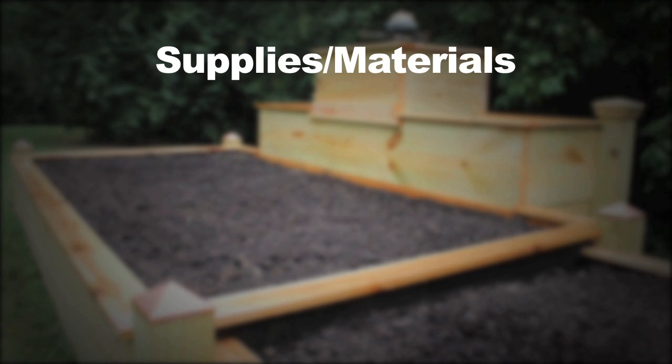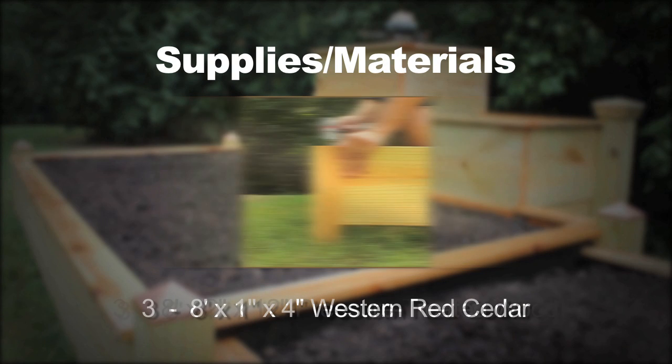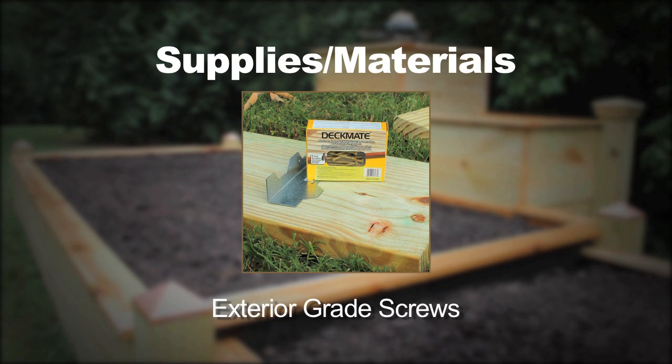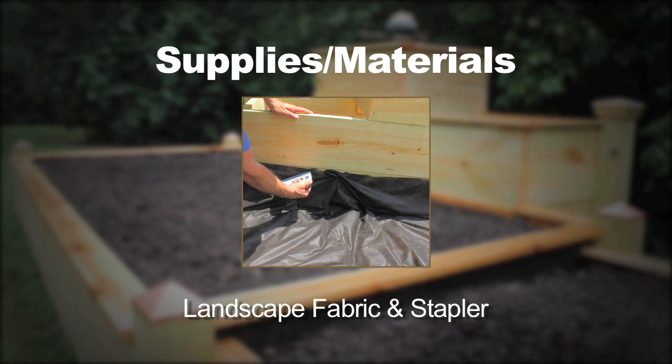For the main bed, you'll need the following materials and tools: 3 8-foot lengths of 2x12 pressure-treated lumber, 3 8-foot lengths of 1x4 western red cedar, a 10-foot length of pressure-treated 4x4, exterior grade screws in 2 sizes, 1 5/8 inch and 3 inch. Galvanized metal corner brackets are optional but preferred, some landscape fabric and a stapler, and enough garden soil to fill the bed.